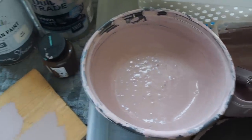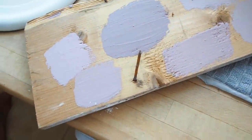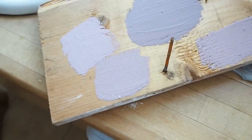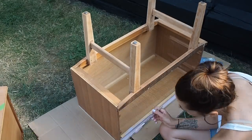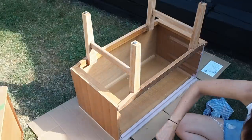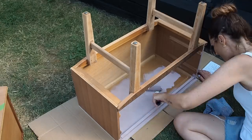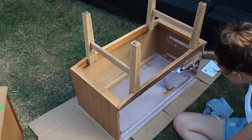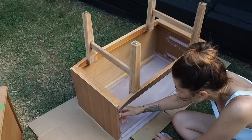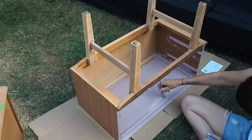I wanted a very specific pink colour to match the wallpaper I'm going to line the inside of the drawers with. So I spent a long time mixing up colours using Annie Sloan paint and some Dulux paint which had a more purpley tone. You can mix up your own colour, test it on a bit of wood, let it fully dry to make sure it's the shade you want, and make sure you mix up enough to paint your entire piece. My mixture was Annie Sloan chalk paint combined with Dulux chalk-based emulsion, so I didn't need to prime the unit — the perfect darkish, slightly purple-toned pink.